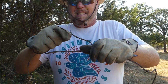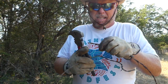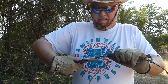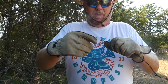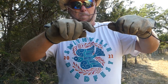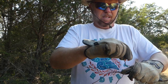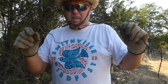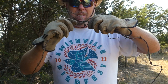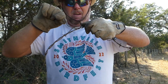Let me show you on this the same thing I was just doing here. If you open up the barbed wire, you weave it into one piece. You take and you unwind the barbed wire on both sides. Now the barbed wire is opened up on one end, and then the other piece that you need to join, you open it up on one end. So now you have both strands of barbed wire. You put them together and scissor them together like that. Then all you do is wrap one clockwise and wrap the other counterclockwise over each way.